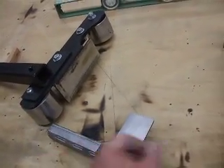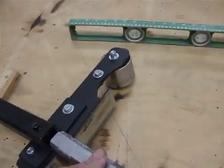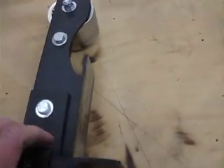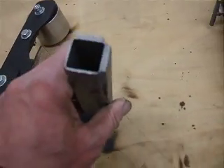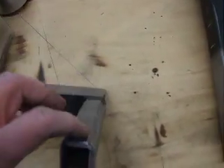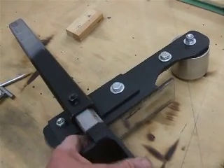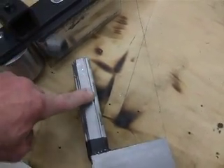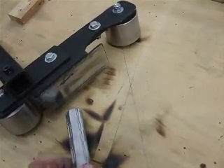Because of the 3/16ths, that's a real oddball size in here. I needed to make something relatively tight so I could put it in and hold it at a 90 degree angle to the front platen. So I took a piece of 1 inch square tubing — pretty thin wall, maybe an eighth inch. I tack welded some flat plate onto the top just to make up the difference so it's a nice snug fit. There's a groove ground into that little plate because when they made the tubing they left a seam on the inside, so instead of grinding that out I just ground a little groove in there with an angle grinder.